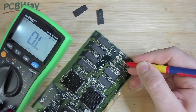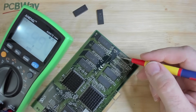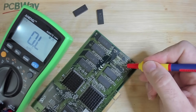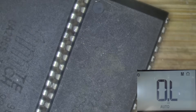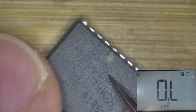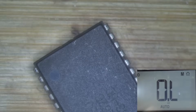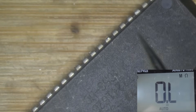So this chip got hot, but maybe the other chip caused the issue. Under the microscope, one of the chips has a marking - this was the chip that got hot. But the second chip that we removed - this seems to be the culprit. It reads 470 ohms - definitely too low. So yeah, this chip is dead. But it wasn't the one that got hot. Very interesting.